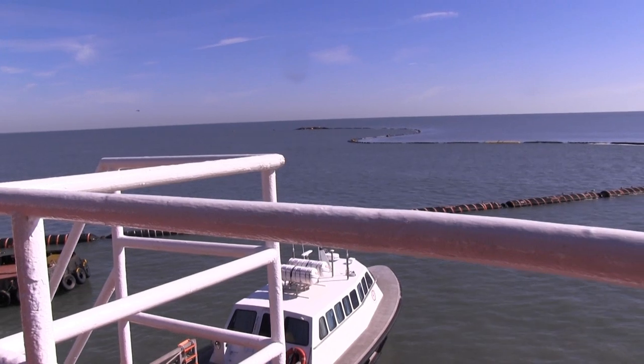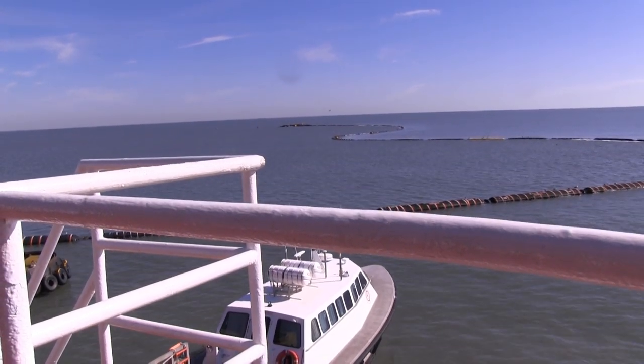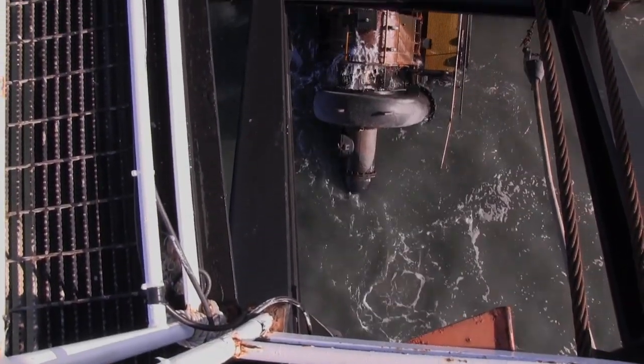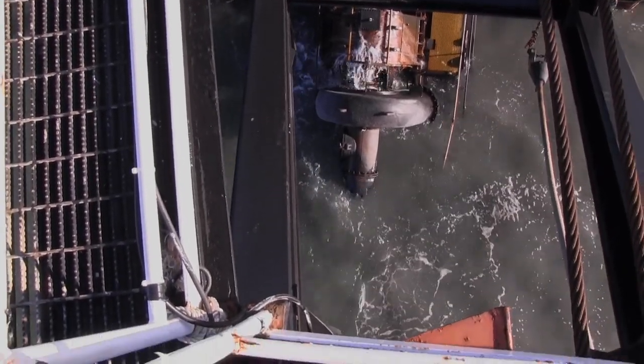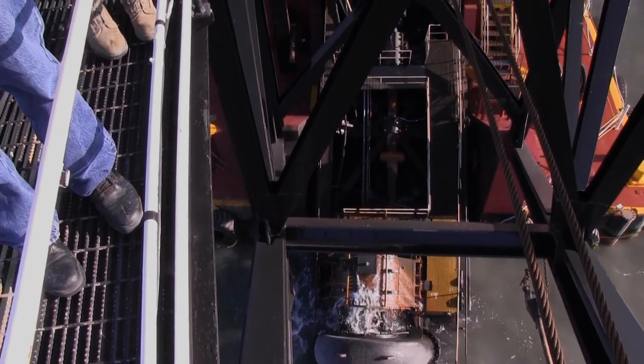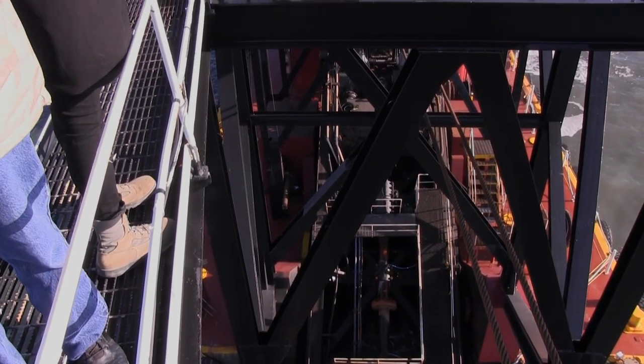We're talking about those anchors now. You've got that stern anchor out the back — that's what holds her on her stern. You've got these two rest wires up front here; these are what holds the dredge. You've got the two swings on the side — those are where those tanks are, and that's how she pulls herself back and forth. So you're moving it by pulling in on the anchor.